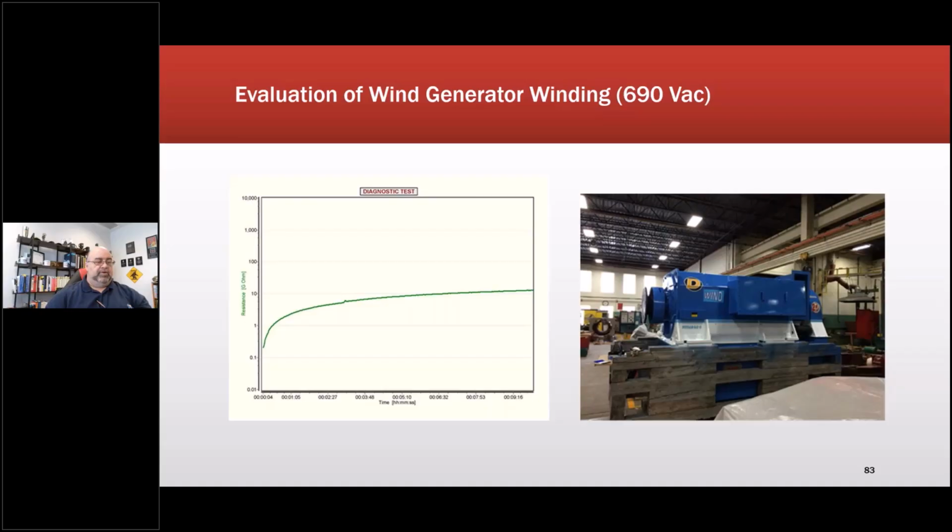No, no PI value of greater than 2. The instrument manufacturer can put whatever they want. I just picked up a portable Megger for a project because there were reasons. It had certain features, and it still had the 1 megohm plus 1 megohm per kV in it. So yeah, a manufacturer can put whatever they want. If you want to follow standards, standards are always the minimum